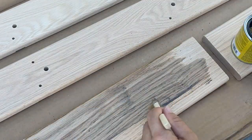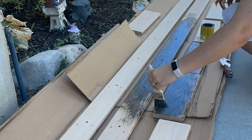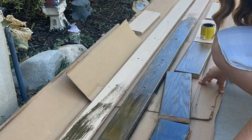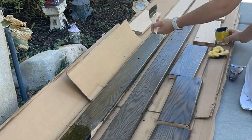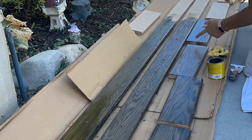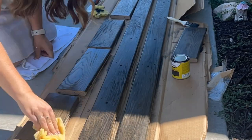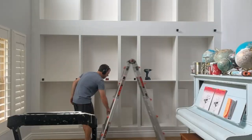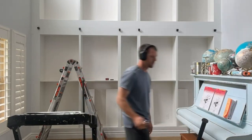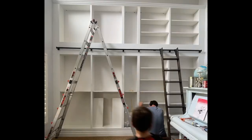For the very last step we finished the library ladder. I stained it a dark brown — color ebony — to match the rest of the wood in my sister's house. I brushed on the stain and used a rag to remove the excess. After waiting two days to dry, we assembled the ladder, added the hardware, wheels, and hooks, and mounted the rail to the bookcase — it was so exciting to finally see it looking finished.